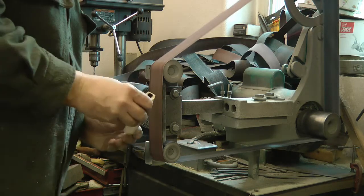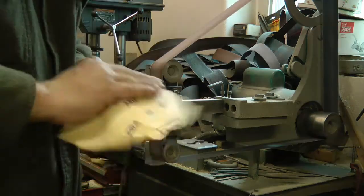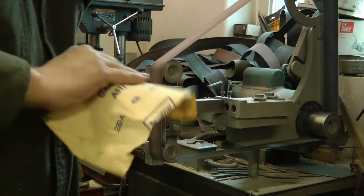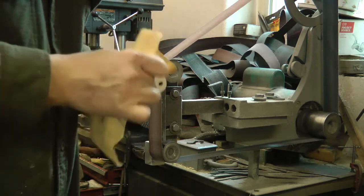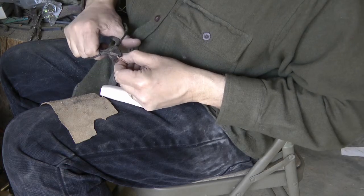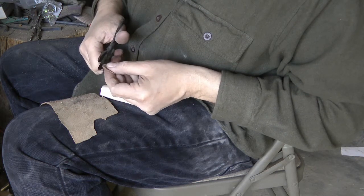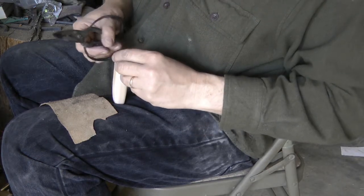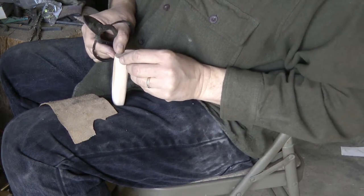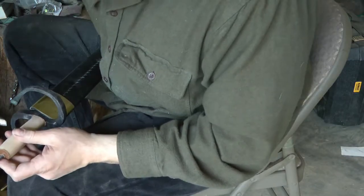The reason there's blue and white on it is that I have the area on the sword masked off where there is etching — the sword was given to my friend as an award. Shaping the outside of the pommel, hand sanding, hand sanding the handle. Then little leather washers that will go between the wood and the metal bits, just as a little cushioning so there's something I can really crank that pommel down on.